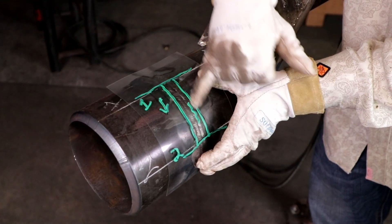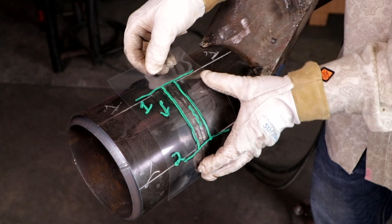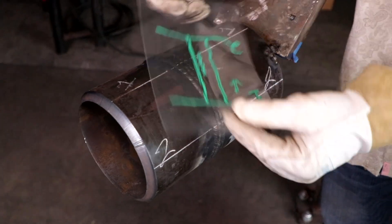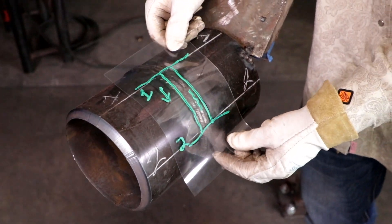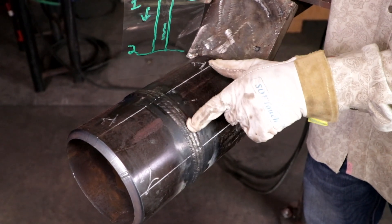You're going to have to take your overlay and mark up your numbers and your bevels. What's in between the two lines here is your bevels, and then this is going to be your indication — whether it be a line, a circle, dots for porosity, etc. Now, you've got to pay attention to which way the overlay is going. It could say one and two, but you don't want to have it upside down. There's going to be an arrow marking which direction it is flowing. You mark it up and you know here's going to be your indication. You take it off and your indication is going to be somewhere in here.